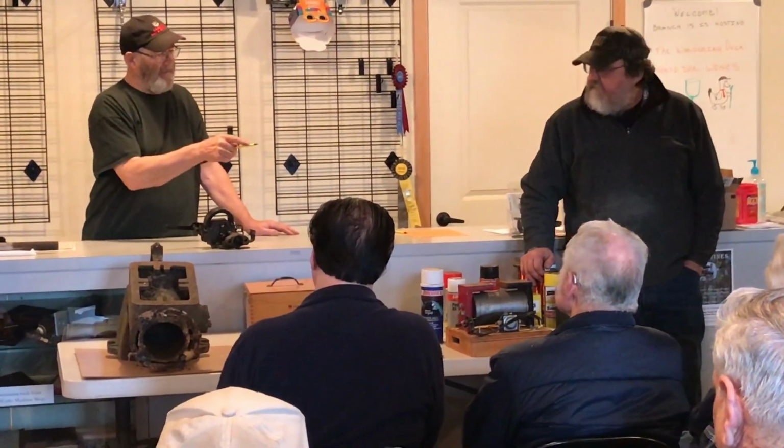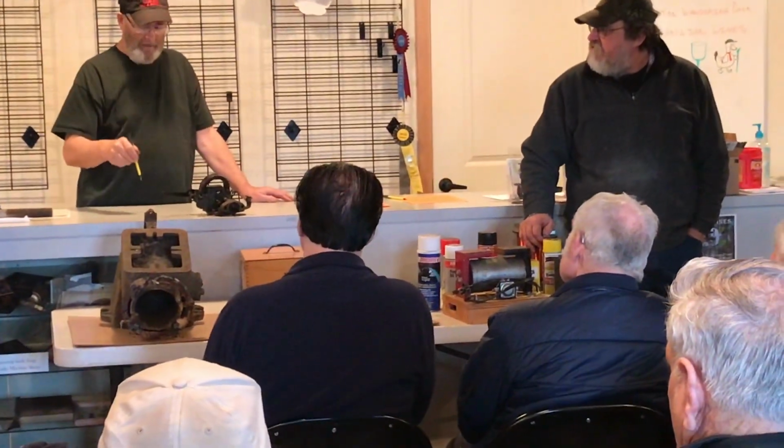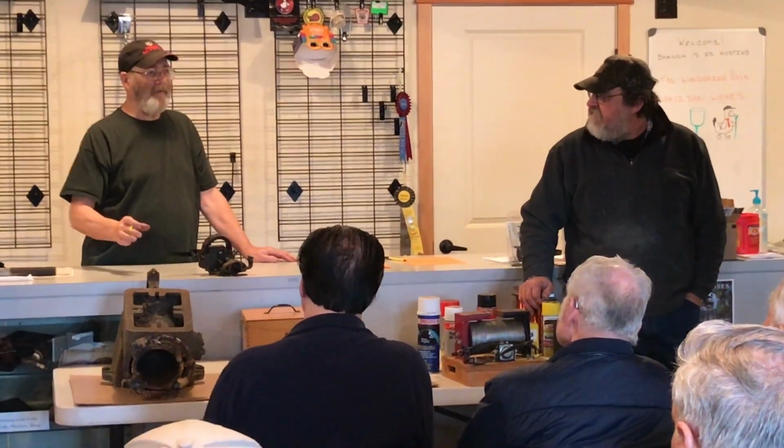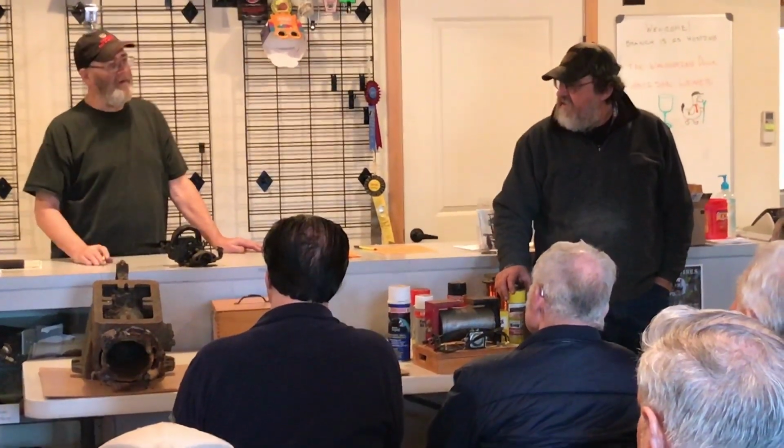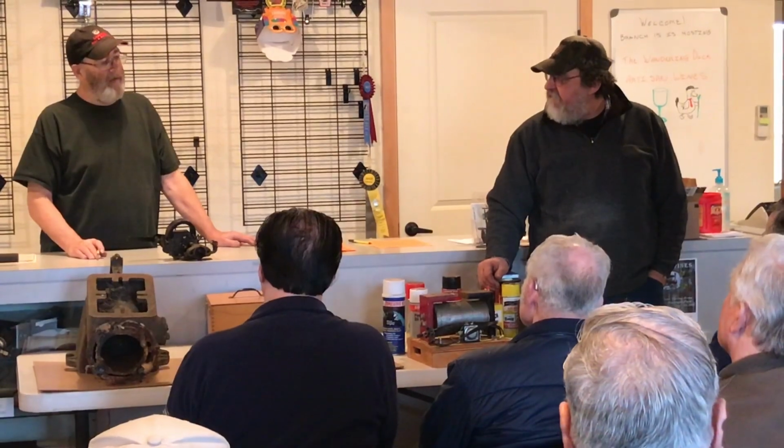The problem with it is, you gotta sandblast it then to get that wax off of that finish. You can't paint over what you've just heated with the wax on it. You really gotta clean it good.